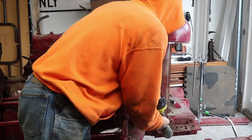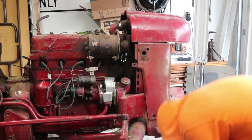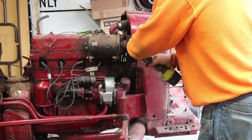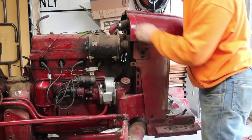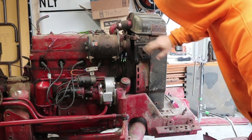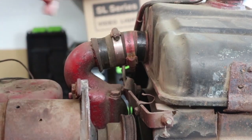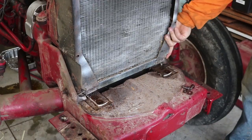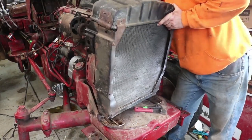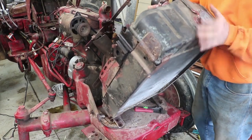So now I'm removing the radiator. The reason I didn't do it until now is because the radiator really defines the front end of the engine compartment — once I start getting the tractor apart more, there's literally nothing to the front; there's no frame and it comes completely apart. On the radiator, there's a piece of sheet metal that has to come off first. The radiator itself is actually the mount for the headlights, the hood, and other components. I removed the upper radiator hose, undid a couple of bolts at the bottom that primarily hold the radiator in place, and ended up having to cut the lower radiator hose. Then I was able to pull the radiator away, being careful of the fan that's right into the radiator.